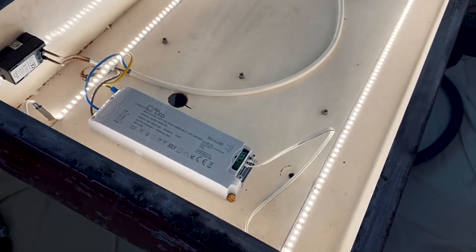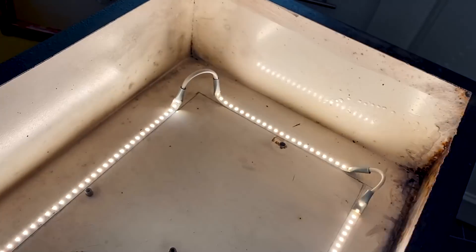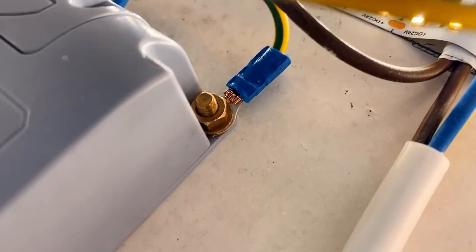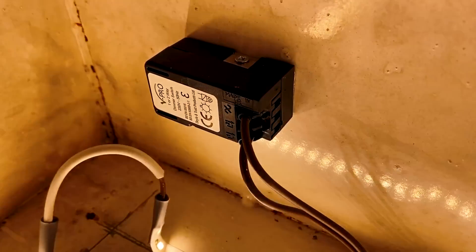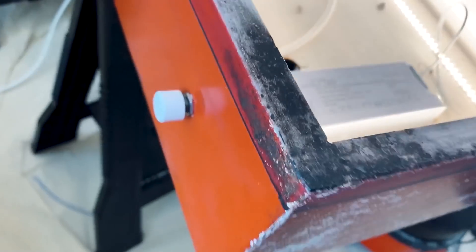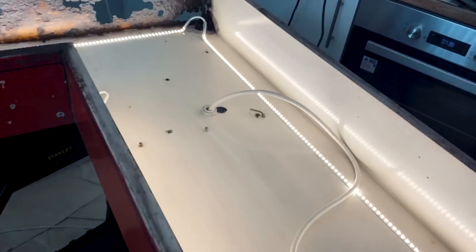The first one is nearly done and I'm pretty happy with the result so far. I've used two-core flex to go in between and do the solder joints with a little bit of heat shrink. Sorry about the flickering — not a lot I can do about that. I've got the cable entry there; I'm going to use those little sticky tabs to cable tie it up properly so it's properly secured. I've earthed the casing using a little lug. The actual driver is Class 2, and so is the dimmer. The dimmer is mounted in here, with a hole drilled through so you can dim the lights as much or as little as you want.